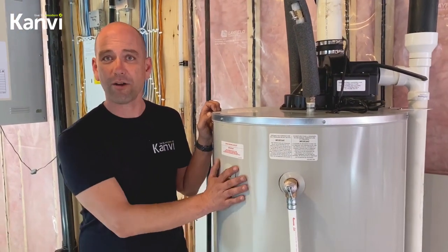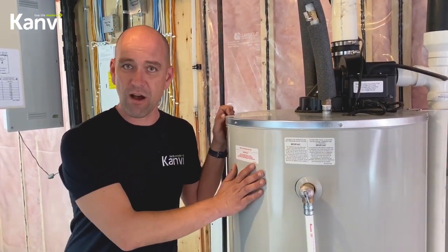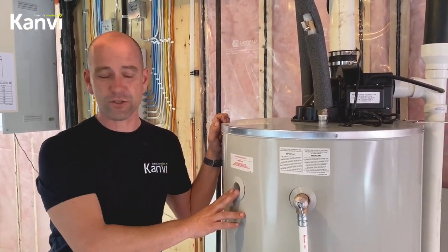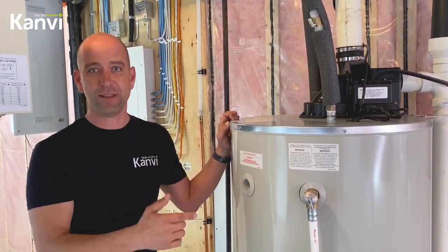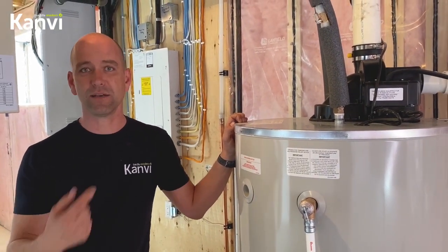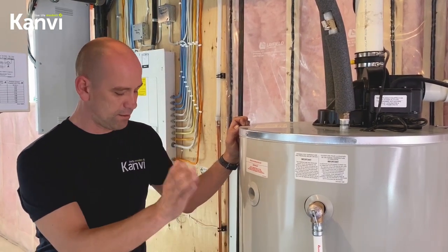The problem is all the water inside of here is super hot. So you want to turn off your heat and then drain your tank by running water through your bathtub or your washing machine — that's probably the best. Once you've done that, you can connect a hose to it, put it into the drain, and let it drain away. Just let it flush for five minutes and most of the calcium deposits will flush out. Once a year is all you need to do.